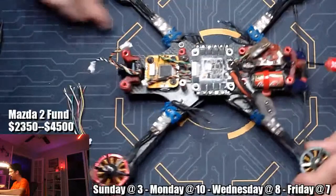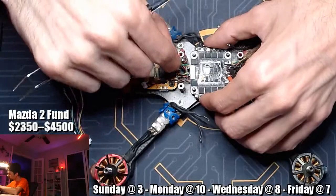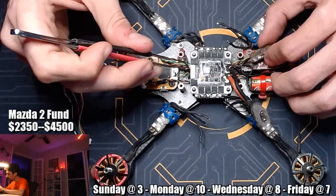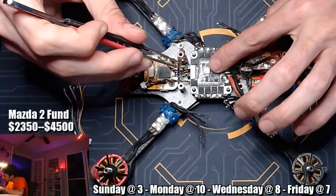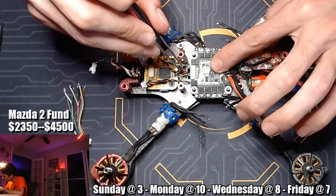We've got our wires managed properly, going under the ESC so that we don't have to worry about them moving all around, getting hung up on the battery straps or anything like that. We've got the wires rotated together here so that they're all neat and tidy. If you believe in twisted pairs, you've got your twisted pairs, although apparently it doesn't really do anything, from what I've been told by people that are much more knowledgeable about electricity than me, namely my father. And yeah, we're pretty much good to go.